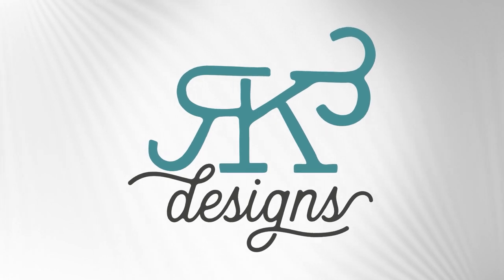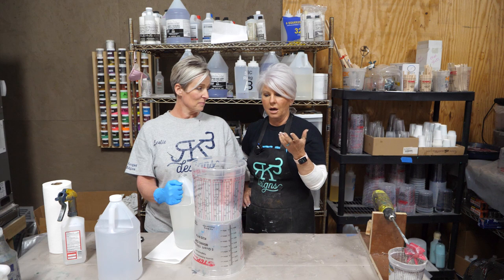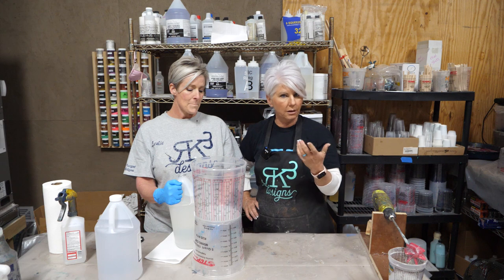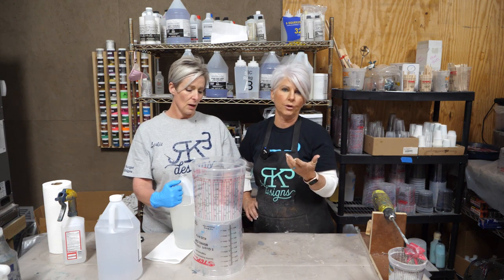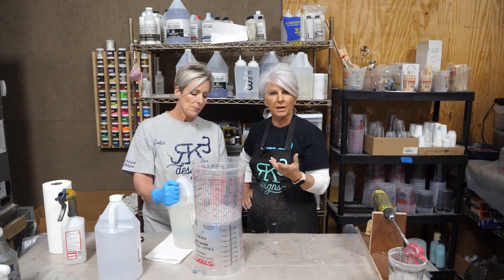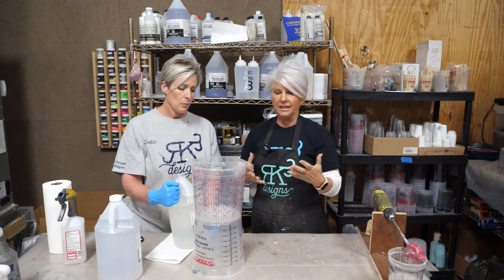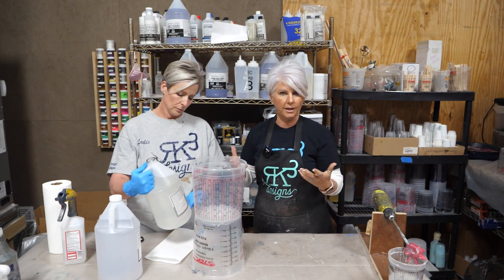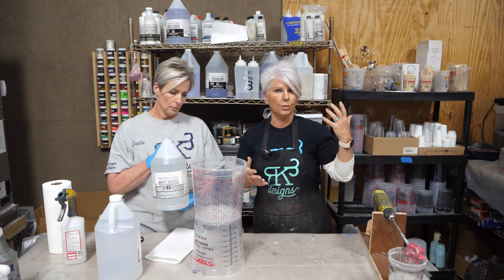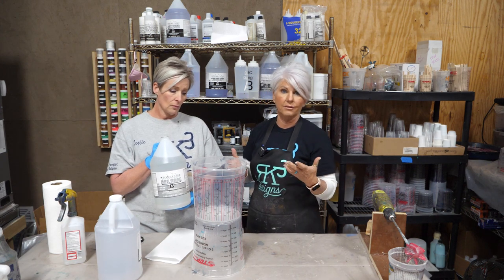In this pour we're going to be doing an exotic pour. We're going to be using seven ounces per square foot, which normally on our normal pours we use three ounces. The reason we're doing seven ounces is because I want a lot of material on the surface to get the reactions we're going to get. So using that much epoxy with the amount of square footage we have, we're going to be using over three gallons of epoxy.